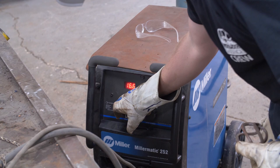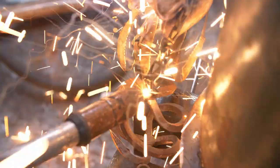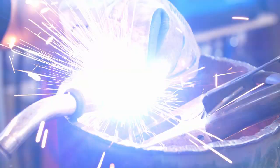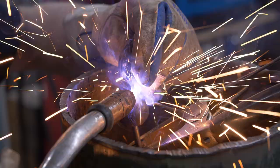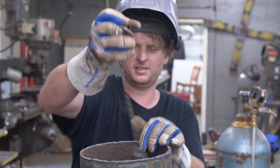I'm drilling a hole through this ball so I can slip it onto the pencil rod — the hole is a little bit bigger than the rod so I can get the correct distance I need inside the bell. I'm just going to tack this chain to what is going to be our ringer handle. Now the last step is to weld it back to the ball. I'm going to give it a pull test because I don't want it falling off on anyone. That feels really good — time to hang her up.